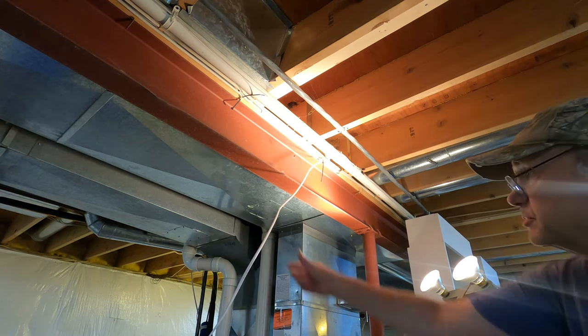So now, whenever the relay is not energized, this line has 120 volts AC on the exposed end of the conductor. So at the very least, you want to put a wire nut on that and tape it to make it safe. Or better yet, I changed the wiring. So now the hot comes in on this side and then goes to the motor.